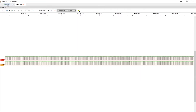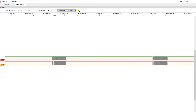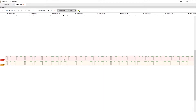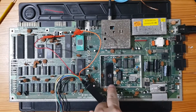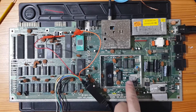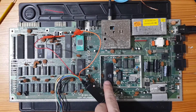That doesn't look right at all. Let's zoom in. You see a regular clock — this should not have any gaps in it. When we zoom in, we've got the clock here and yeah, it looks like there might be a clock issue. That would point to the VIC chip and the clock circuit. The VIC takes the crystal, but unfortunately my logic analyzer doesn't have a high enough resolution to measure nearly 18 megahertz, so I can't check the crystal directly.